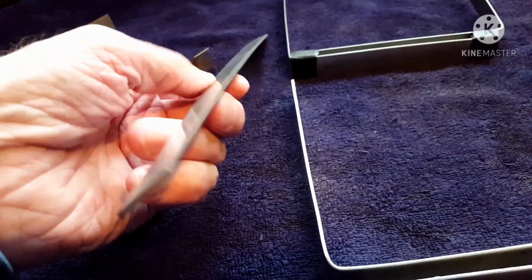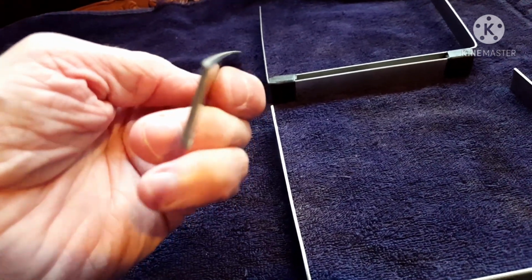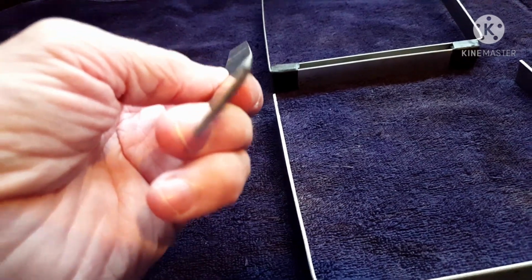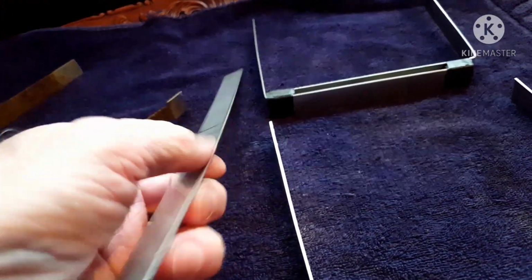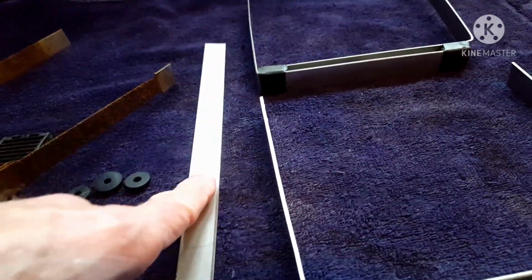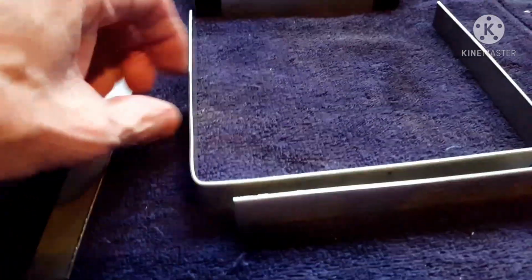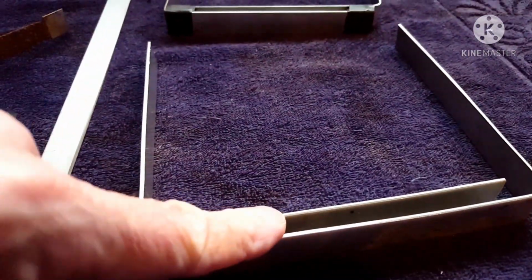And when they stamp it out, they use the shear on it. You can see it gets kind of kitty-wampus there, so I do have to spend some time at the vise straightening out that angle so it's straight. But the design is 3/4 inch wide, a foot long, 6 inches. I bend it over at 90 degrees, so it goes in like this. Here's one that's completed. The plates have to be 1/4 inch apart.